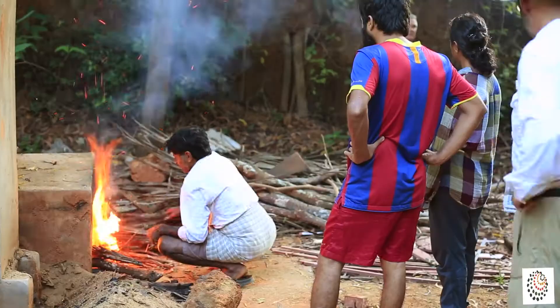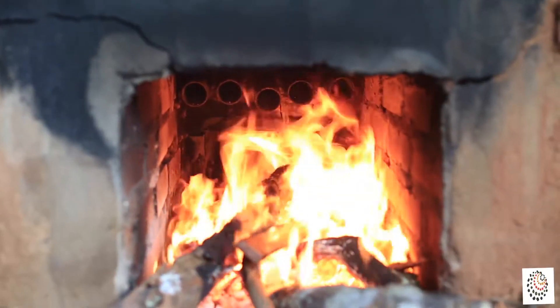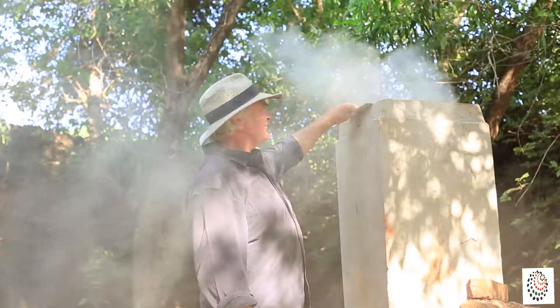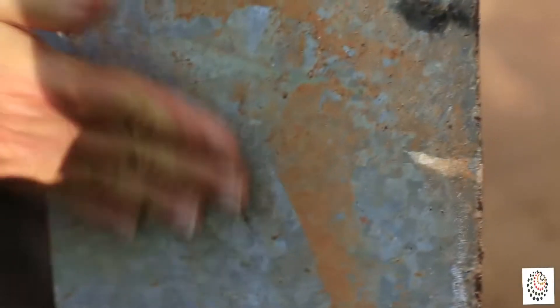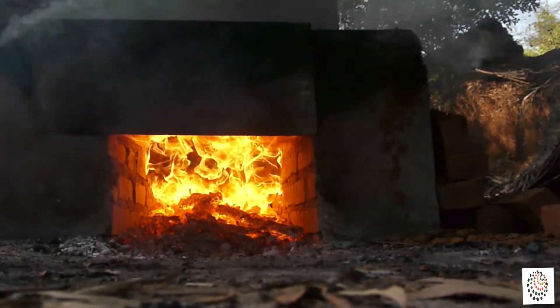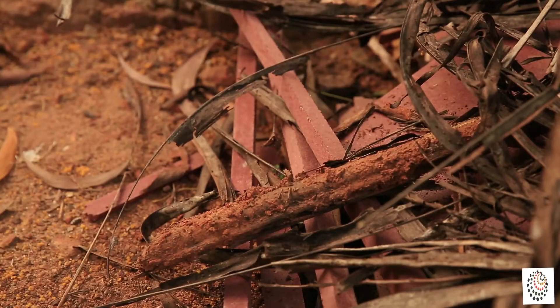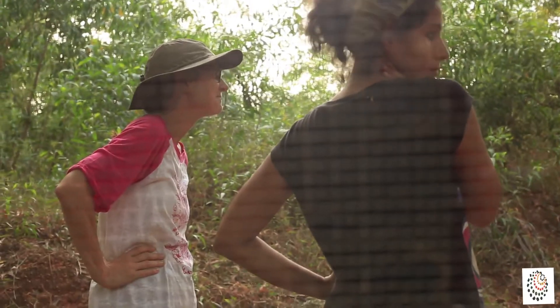A fire made from waste wood and residual biomass in the firebox removes the moisture from the wood. You can see the water vapor coming through now — so we've got moisture there, nothing else. We've got the first stage started. Unlike traditional kilns, the retort requires substantially less wood to be burnt in the process of drying and heating the wood to initiate the carbonization process.